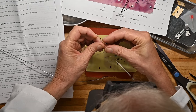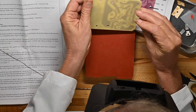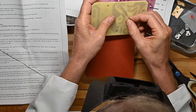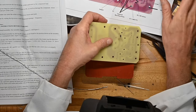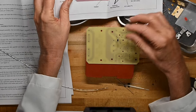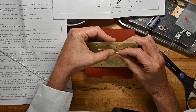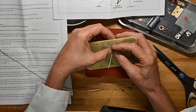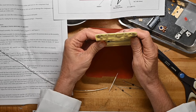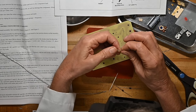I'll use this toothpick to wedge them up. There's one right there. This is a little funny to figure out because you have to hold it up and look at the material behind it. The silver band will go where the broad line is on the drawing. Since these need some space underneath them for heat dissipation, I'm going to put them on first — they're staying up pretty well. That's probably a good eighth inch minimum.